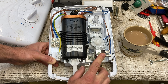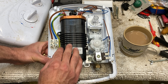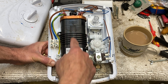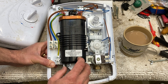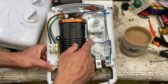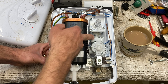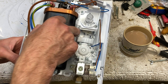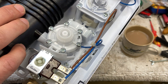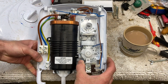It just opens and closes the valve, same as in a washing machine. Water comes in, into here, goes in through this cylinder, and there's a pipe that comes up from the bottom all the way through the centre, and the water comes out through that pipe — very simple. This thing here is a little pressure sensor, and I presume it's set to one bar. Once it's over one bar this thing will pull down; it's got a little plastic hook that hooks onto that cream-coloured piece. That is the low-pressure warning, and it'll stop working if there's low pressure.